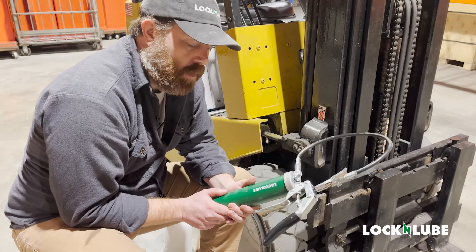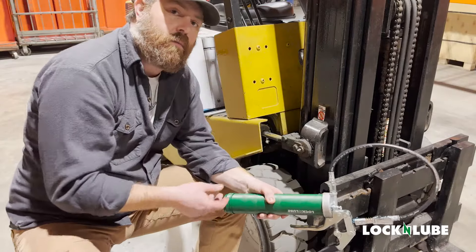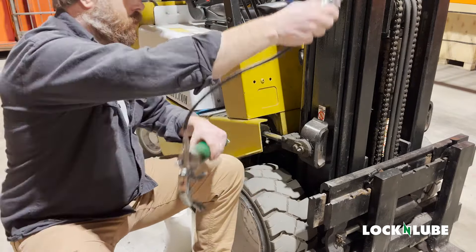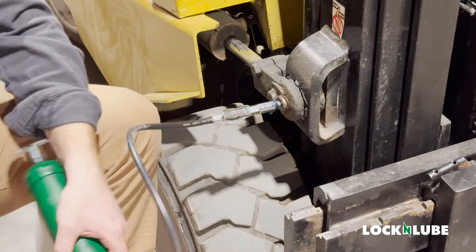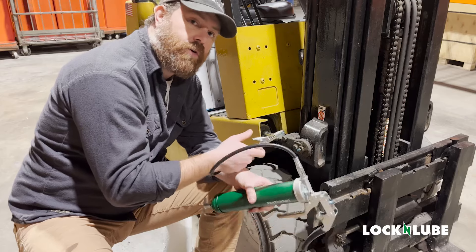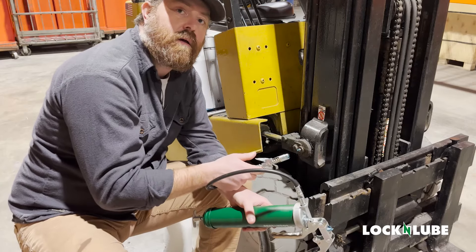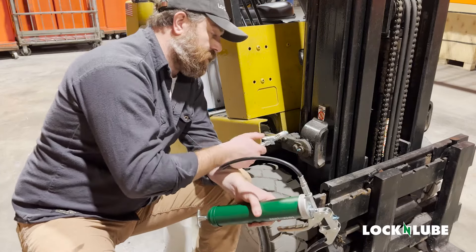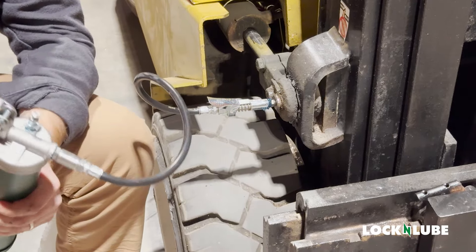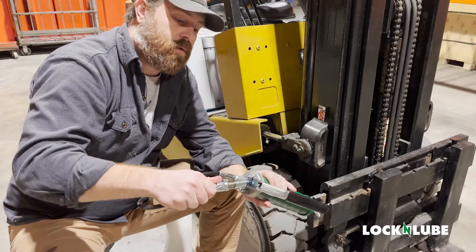So using the off-brand grease gun, we have had to go through and actually re-tap the threads so we can get more of a bite on it. The Lock & Lube grease coupler, being able to lock on to your actual fitting and then having the ability to easily take it back off, keeps any kind of side load or side pressure from pulling on the threads of your zerk fitting and potentially damaging them. We've spent a lot of time trying to get this fixed and back in service. It still does need grease, so we're going to use our Lock & Lube grease coupler to attach — fitting's taking grease, perfect — and easily disconnect. We're going to lock our grease coupler and store it.